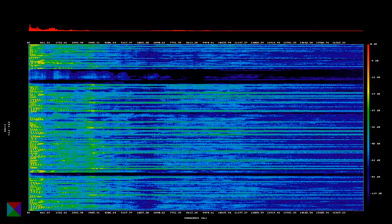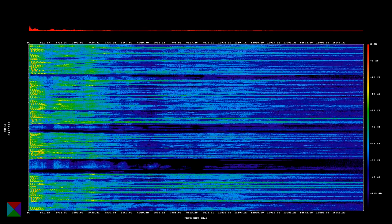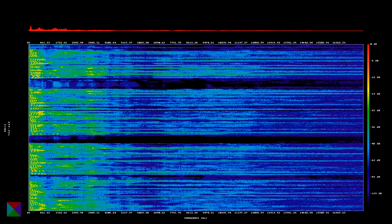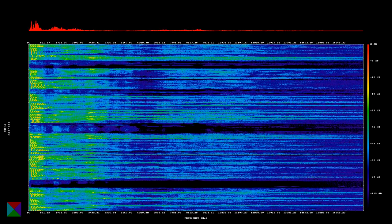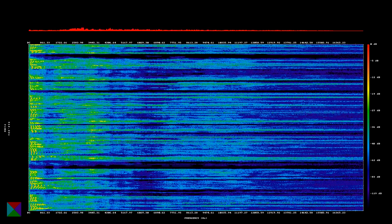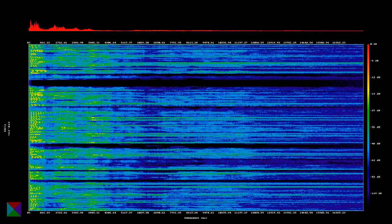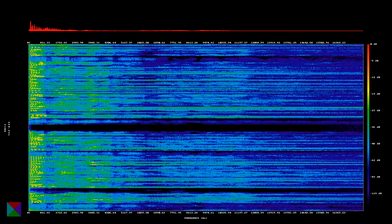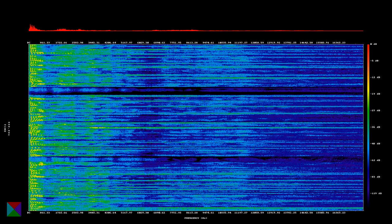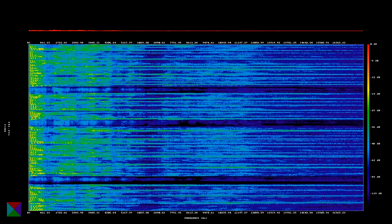Back to the power output on my beacon transmitter. Assuming for a moment that I had an actual tool available to measure this, I'd still be comparing my tool against another standard. Let's imagine that I could measure the power output of my beacon with an oscilloscope. When the oscilloscope says one volt per division, how do I know that it really is? If you start reading the calibration steps, you'll discover that they state you need to connect your scope to a reference — another word for standard. The volt is defined as the electric potential between two points of a conducting wire when an electric current of one ampere dissipates one watt of power between those points. The ampere definition involves counting elementary charges moving in a second — on the order of 10 with 19 zeros. This is a rabbit hole.